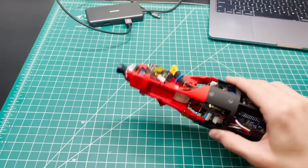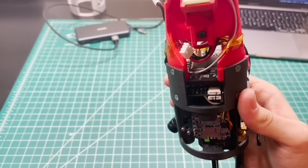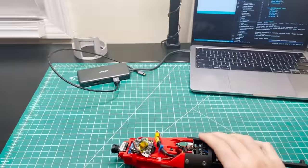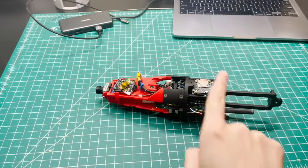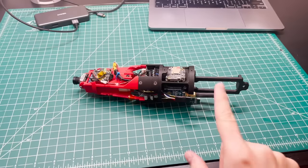And the flight code will start out with a self-diagnostic test, looking at all of the different sensors and making sure that they can connect correctly. So we'll do that, make sure everything's soldered together and wired together correctly just on the AV bay. And then once that's all checked off, we'll connect it to the rest of the rocket and try to get those fins to move.